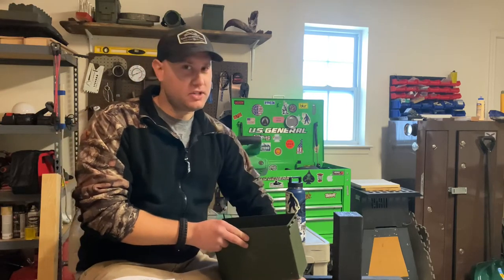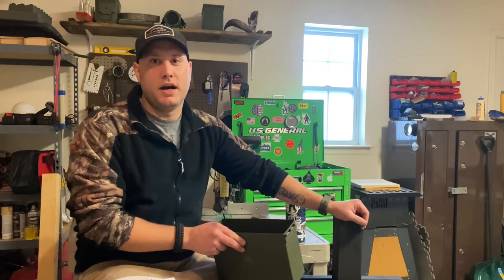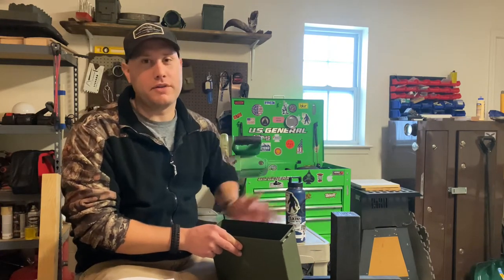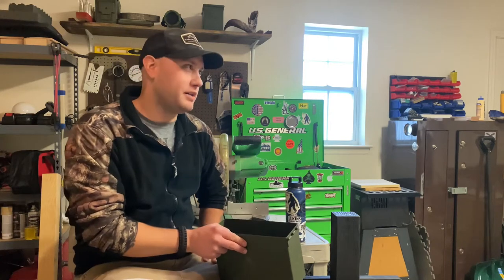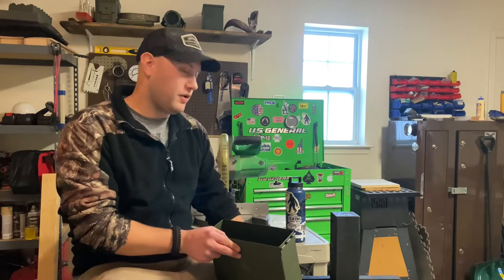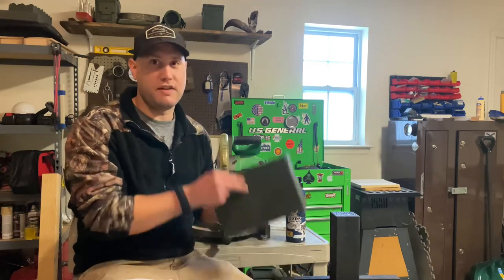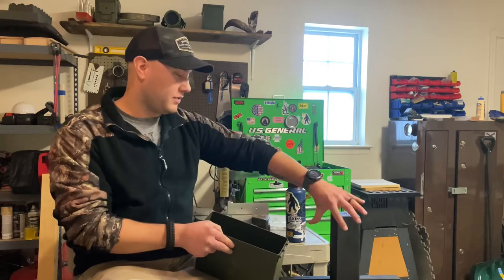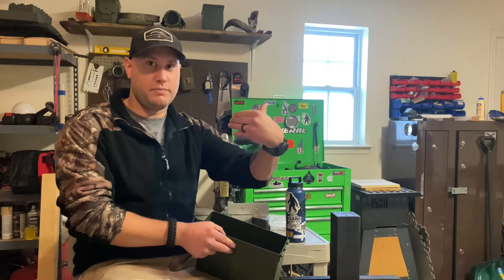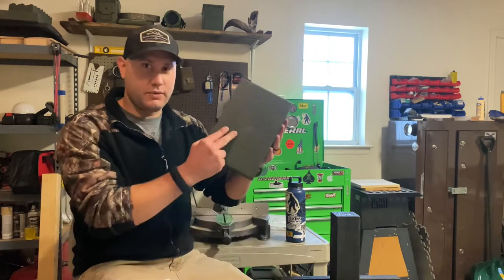If you have one straight piece of wood on this, because I'm using rough lumber or pretty much construction grade lumber. The legs, you want everything always to be as straight as you can, but especially around here in Wyoming, it's really hard to find straight boards. But if you have straight boards, the most important part, I would say, is the arms of this, if you're putting these in. I've had one where I didn't plan on putting cans in it, and one of the arms was a little bent, and I had to chisel and saw and sand the crap out of it to get one of these cans in.